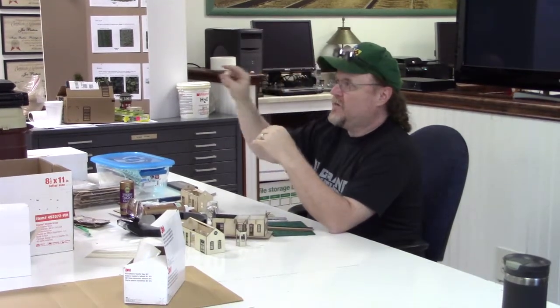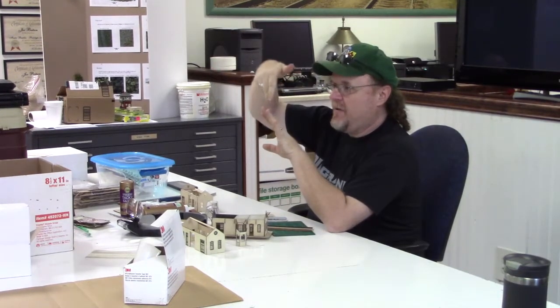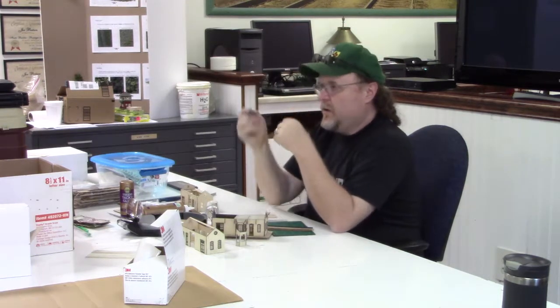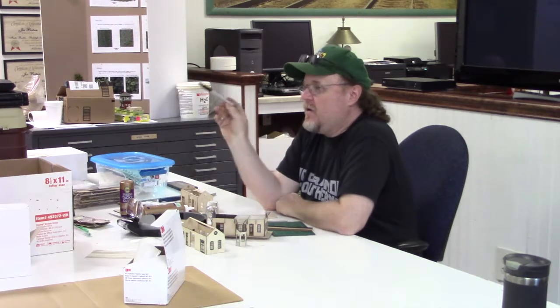There's a line of tar to help seal the row atop it, and then above it is black granules, okay? Take the Sharpie and color the upper half of each row black. Or take your alcohol and India ink stain and stain all your rows of shingles before you put them down.